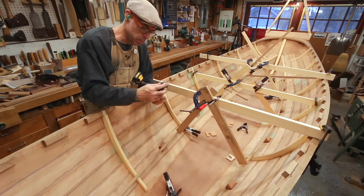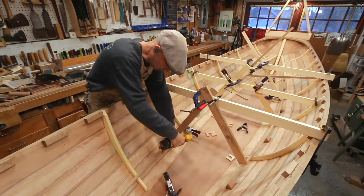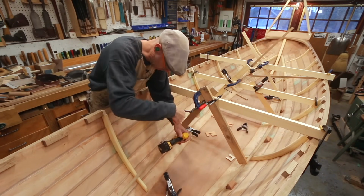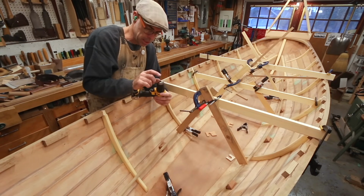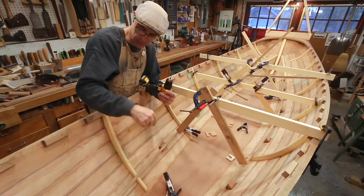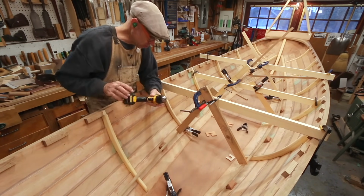Okay, I've got this set up with just a 3/32 bit, and I'm going to just eyeball center on all of these guys and square to the direction that it has to pull in. And I've set this drill bit up so that at its longest is as deep as I can go on my shortest run. So I'm not going to worry about blowing through the planking anywhere.